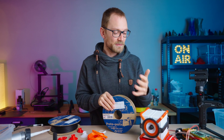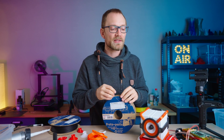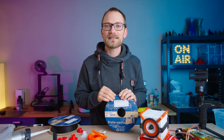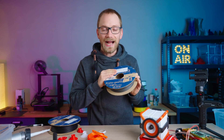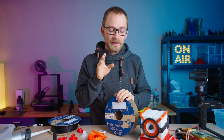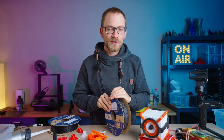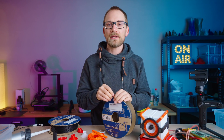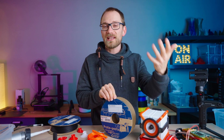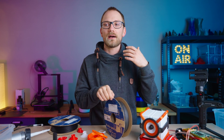Now for the magnetic portion of the driver, there are magnets that produce the magnetic field and washers that shape it into the form we want. For the magnets, I don't think you could magnetize the iron-filled filament enough to be usable — it's just iron powder in PLA and it's not gonna produce as strong a magnetic field as you'd need. However, for shaping the magnetic field and getting those field lines to flow through your coil at the perfect angle — kind of acting like a transformer core — this could actually be useful. In inductors for power stages on computer mainboards, iron powder resins are already the go-to core material.